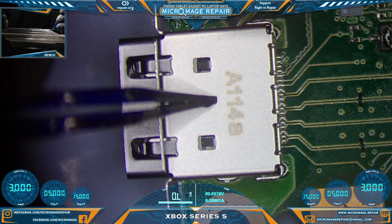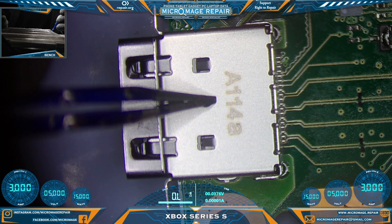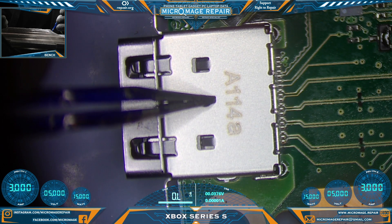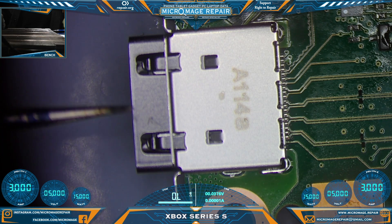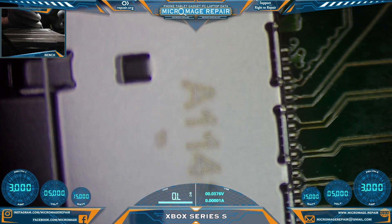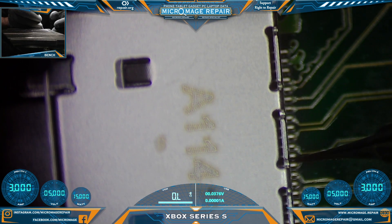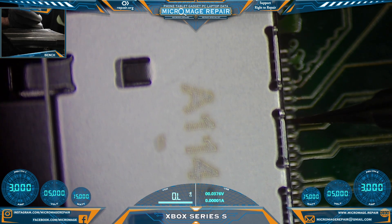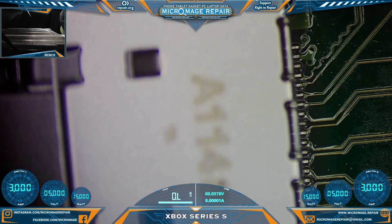Close down, give it a little bit more — I'm not keeping the heat anywhere long enough to do damage. Pull it down while the solder drives, and then we'll see how we did. These boards take a tremendous amount of heat, so don't get real concerned about burning something. There are limits, but you would have to work really hard to hit that limit. Okay, now I want to do a nudge test and see if we got our hidden joints — oh man, that feels rock solid. Excellent. We do need to check our pins, make sure we managed to solder them down. Excellent — rock solid.